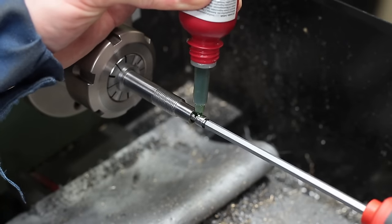This thread together with the second part will make this nut adjustable to minimize the backlash of the spindle. With the outside finished, I now have to prepare the part for the internal Acme thread. For the internal thread, I bought this 8x2mm Acme thread tap. There are people on YouTube making these taps themselves, but for less than 10 euros, I wouldn't spend a minute on making this — so I chose the easy way here.